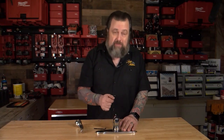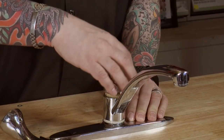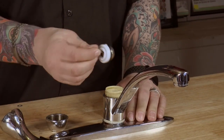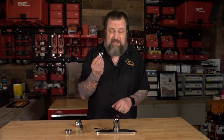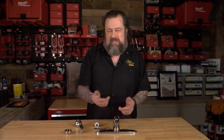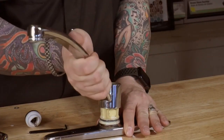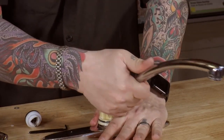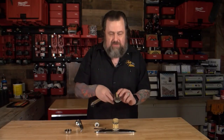The next thing is this crown here takes a little bit to get off. If this hasn't been repaired in 20 or 30 years, it could be completely crusted up, so you're probably going to have to fight it a little bit. But they make a little tool that comes with the kit when you repair this. So this crown will come off, and now you're getting into the inner workings of the faucet. This is where their little patented Delta stainless steel or brass ball is — this is what controls everything, hot, cold, off, a little bit of water. That's the secret.